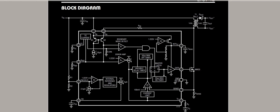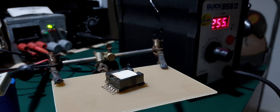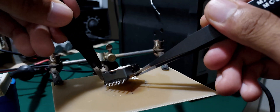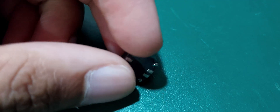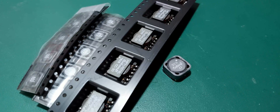Back to the bench: we have established that secondary discharge takes up a lot of the charging cycle, so reducing secondary inductance and therefore turns ratio is the best solution. I need to make a transformer with a smaller turns ratio, and the most logical thing would be to take one of the existing CoilCraft DA2034s apart and remove some turns from the secondary. Even with my heat gun maxed out the epoxy refused to melt, and the windings appeared to be interleaved anyway. So I will be using four of the 22 µH variant from the MSD1048 1:1 coupled inductor series — primaries in parallel, secondaries in series — to give a 1:4 turns ratio with 5.5 µH primary and 88 µH secondary inductance. The 5.5 µH primary is not a coincidence; the LT3750 has a minimum inductance limit that depends on turns ratio.